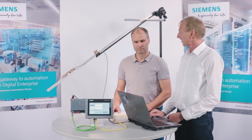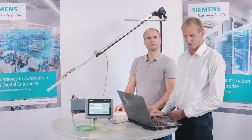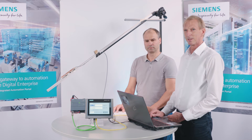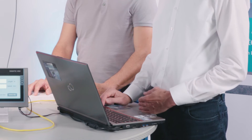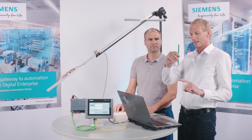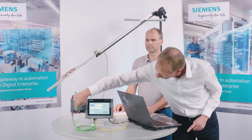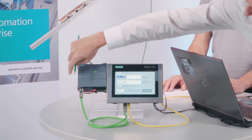This whole setup was too complicated for my application here, because I did not want a motor. I simply wanted to solve the problem differently while also using the counter. What I actually wanted to measure is a workpiece — such as this pen. I have two light barriers, and when I drop the pen, I want to determine how long it is as it falls. So I take the first input — that's the capture input — generate pulses from the CPU output, and feed the pulses directly to the input, which means I can do without the rotary encoder.